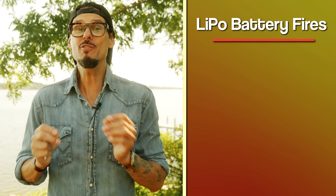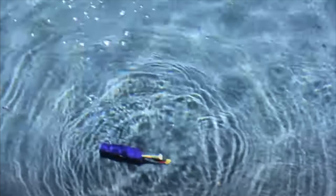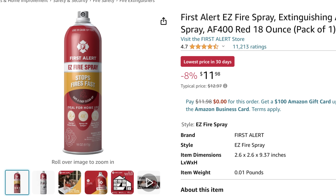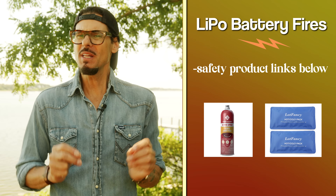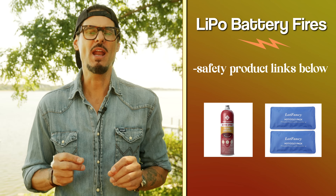Lithium polymer battery fires are more common than I thought. It's less common in smart LiPo batteries because of their safety features, but LiPo battery fires produce their own oxygen, so you can't stomp them out or pour water on them — here's a LiPo battery actually burning underwater, producing its own oxygen from combustion. You need a fire extinguisher designed for chemical fires. I found a small chemical fire extinguisher on Amazon and ordered one — I put a link down below, along with some other fire safety products for our hobby.